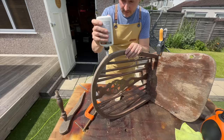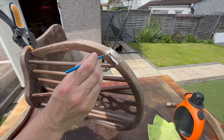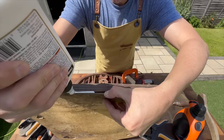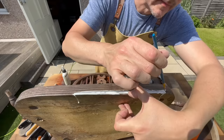The piece bent halfway down so I was pretty happy with it and it looked like there would be much less tension, so I applied some sawdust and glue, clamped it down, and left it to dry. There were many little bits I had to fix - because this was plywood, the bottom ply had delaminated - so I applied some glue and lots of clamps and that just did the trick.